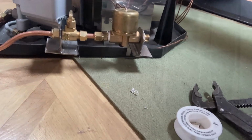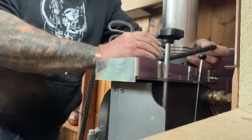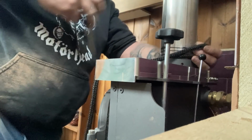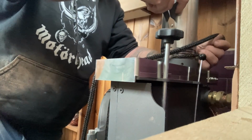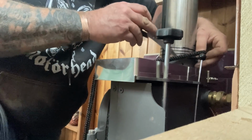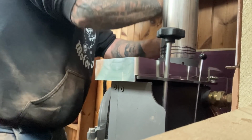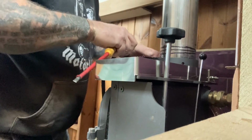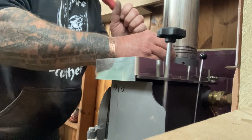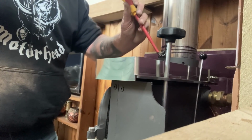Okay, there's the fire valve and the isolation valve. Right, just preparing to run this stove for the first time. Recommended that I use rope to seal this collar. Very tight, mind. Lightly put a couple of turns of that in, once I know the fire isn't coming back out.